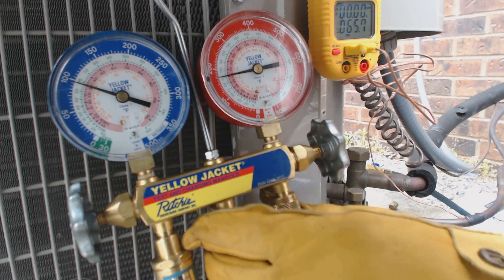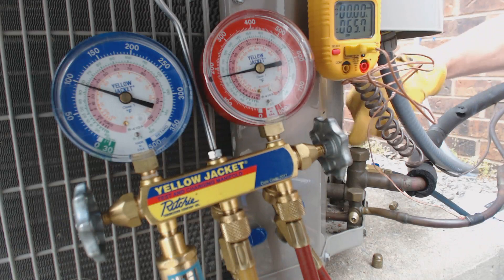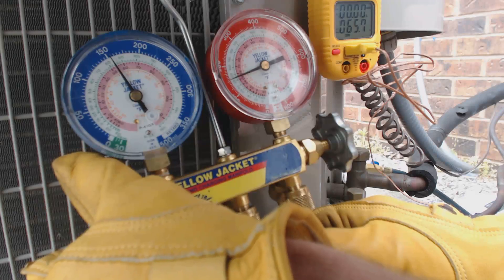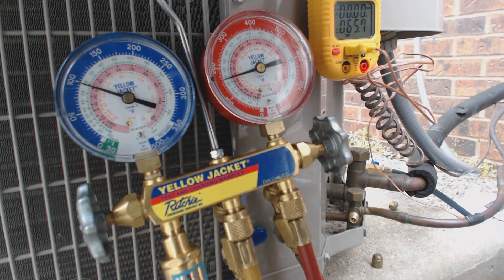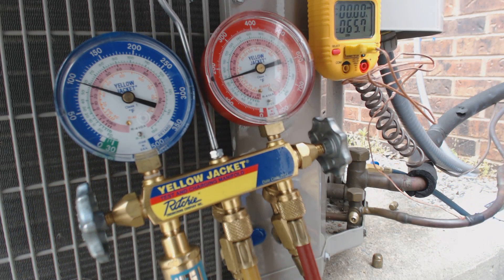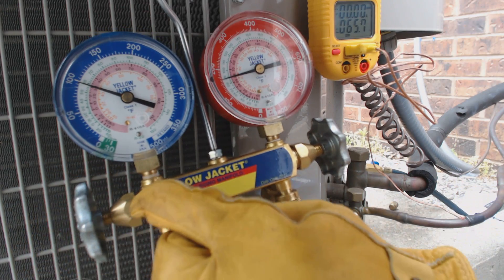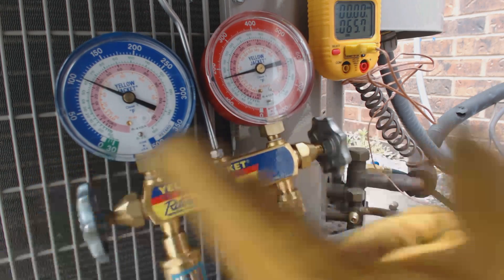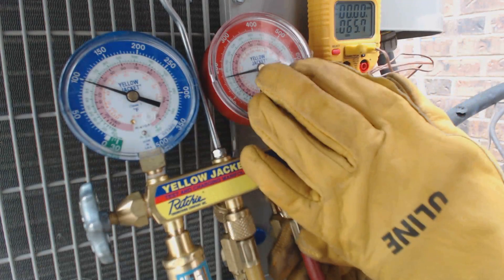Now we're ready to charge our disconnected red and yellow service hoses — the liquid inside of those — into our liquid vaporizer, and it goes into our suction line right here, our large suction line. This liquid vaporizer is protecting our compressor. If you hear a whining noise from your compressor when you're dumping your liquid refrigerant in through the vapor line into the suction side, that's not good. If you do not have a liquid vaporizer, you would want to just do it real quick, using the gauge as a metering device. But if you buy an additional vaporizer, it's a lot safer. I hear absolutely no whining — you just want to do the safest thing possible, a little bit in at a time.